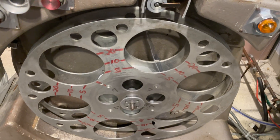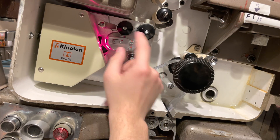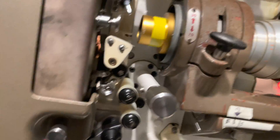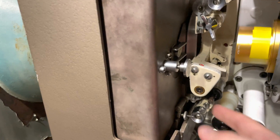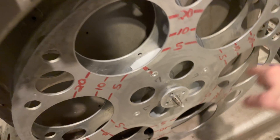Now what we always do is go backwards to verify the threading. We check backwards — feels okay, closed. Go through here — correct amount of tension there. Check the pinch right here — good. We go back up through our threading path — that's correct. We check over here to make sure the loop is good. We make sure it's not getting caught on anything. This looks good over here. We check to make sure this is pushed in, and also check to make sure this is pushed in. Runs through there, goes all the way back up. Tab closed — and we check one more time to make sure it's going clockwise and that this tab is closed.